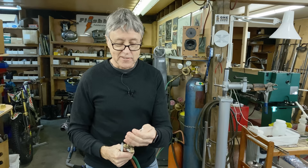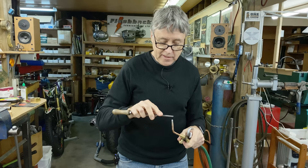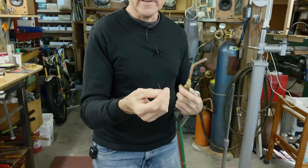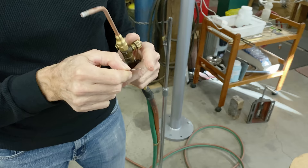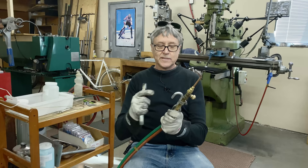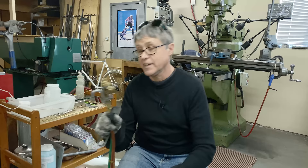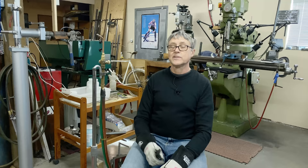We need a clean nozzle. I've got a little flat file here, and you can very gently file it — you can see the copper come through. Then I've got a tip cleaner; this is the one that fits my zero tip. Gently — it's got a little file on it, but you don't want to enlarge the nozzle. It's a Victor torch, a J28. I made this little holder out of aluminum, held with a hose clamp on a mic stand. Very handy having a place where you can put the torch and take it out at will.